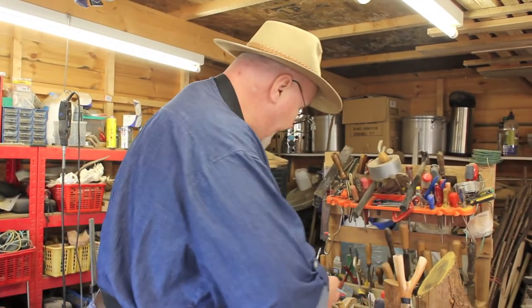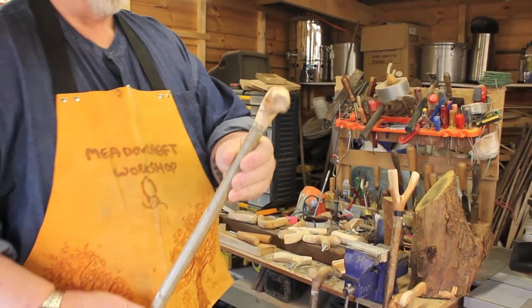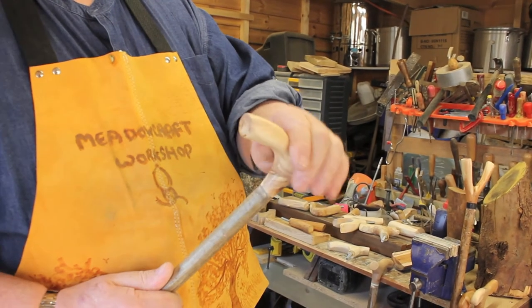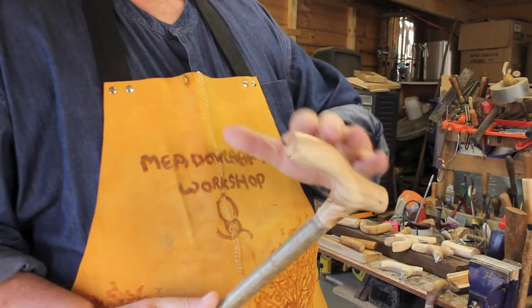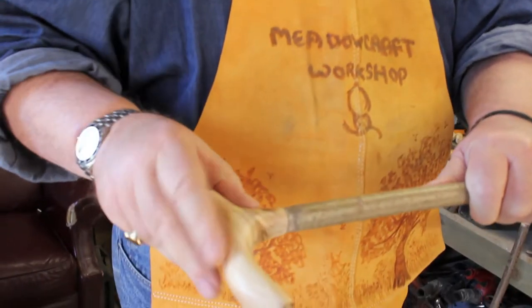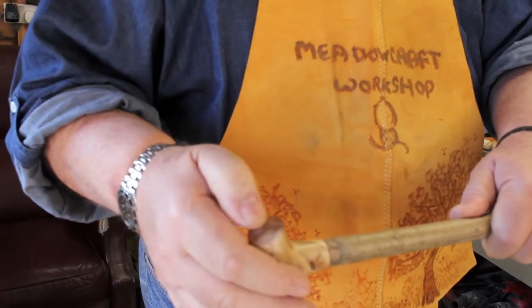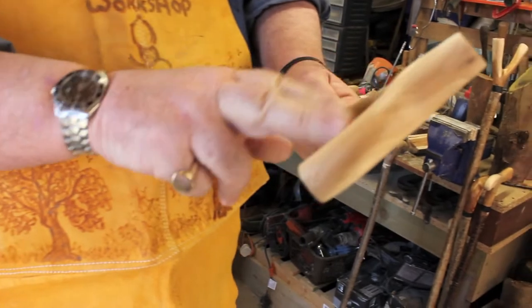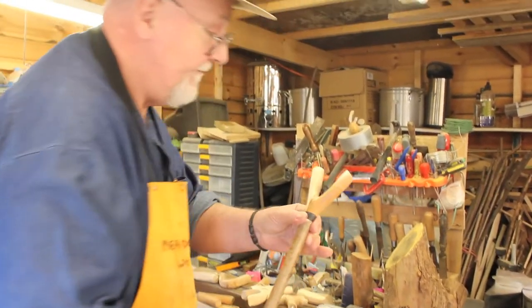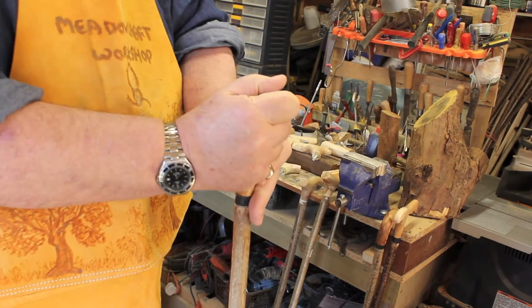Having done that, you then get into it with successive sandings. Here's one in that shape that I showed you - this has just been taken down to the ultra fine hand sanding material which is 600 grit. I use 600 grit and then triple-O steel wool to give it the final sheen. As you can see, although this has just been sanded with no oil treatment, it gives you this beautiful almost coffee ice cream effect with the darker heartwood - you can see where the heartwood runs and how the lighter outside wood grains. That's a really nice thumb stick - already gives you a polish feeling.